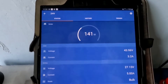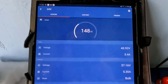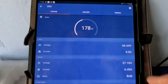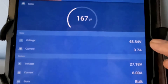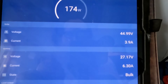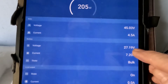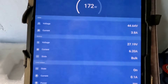Now I'm charging at the higher voltage with those three panels in series. Those 300 watts tied in series are just now starting to come into full sun — it's getting to be late morning, but where they are it takes till late morning before they start catching this kind of wattage. You can see right now: 180 watts, roughly 43–45 fluctuating volts, 3.8 amps. Battery voltage is 27.2 volts — this thing's just about ready to kick over into float.